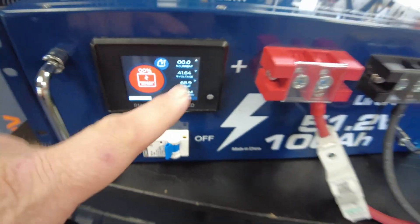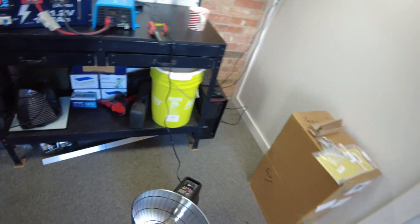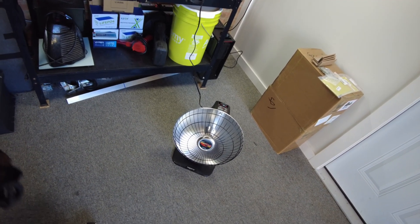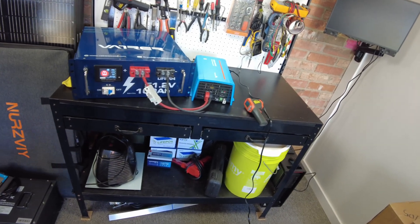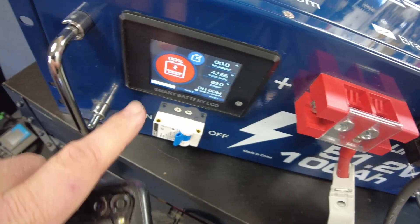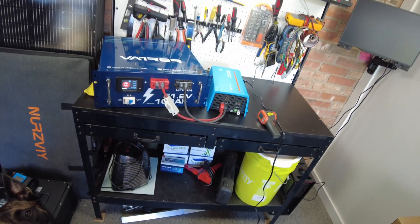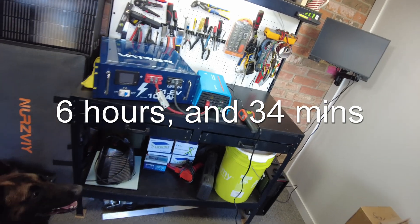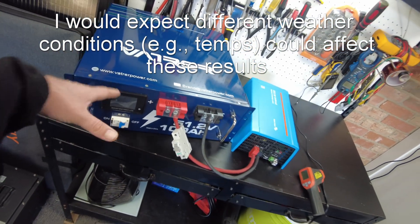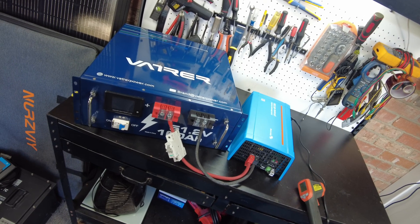We're at zero percent but it's still cycling on and off. It is 10:34, coming up on completion. Watching it closely — I think it's completely done now. I haven't seen it cycle back on and the inverter has turned off. 10:34 was the last cycle. So there you go — we got approximately six hours and 34 minutes of run time with this heater on medium, running from a 100-amp-hour 48-volt rack-mount battery. Let me know what you think about this experiment — thanks for watching and I'll catch you on the next one.